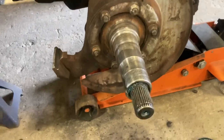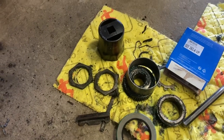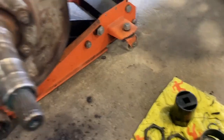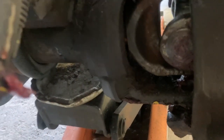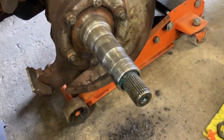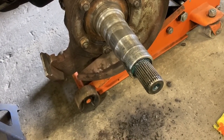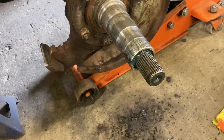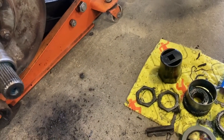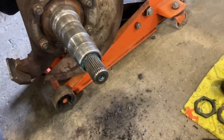People like Yukon Gear and Axle can get them as well. These use a drive flange — there's the gear that goes on these. Of course, there are no locking hubs on these units. They're always turning one direction when they're shaving ice. So you want to make sure you check your U-joint out really good. U-joints can break — we've had an axle snap here on the short-side axle. The reason why is mostly when they're dumping outside in the Zamboni dump, driving over the asphalt. Since there's no way to unlock the front diff, the axles are going to twist a lot. Short wheelbase on this unit and a short axle as well because these are narrowed.